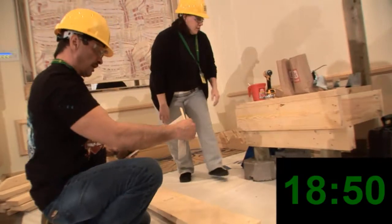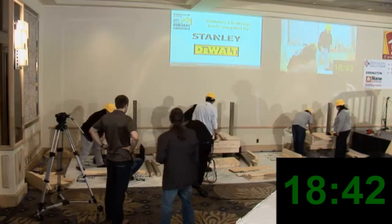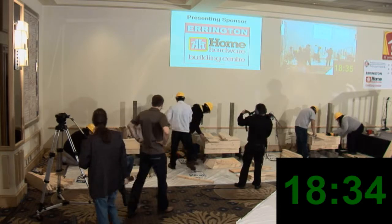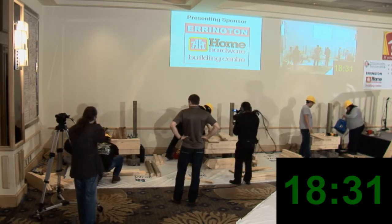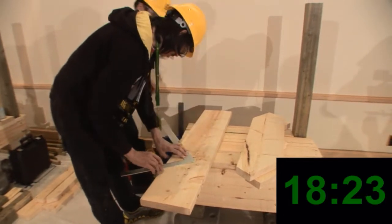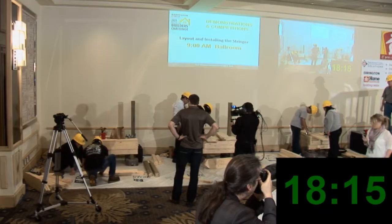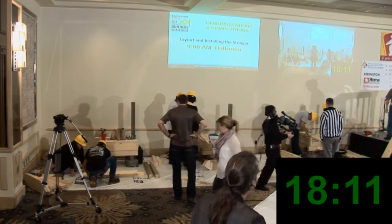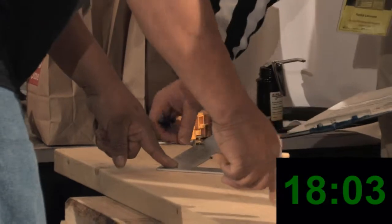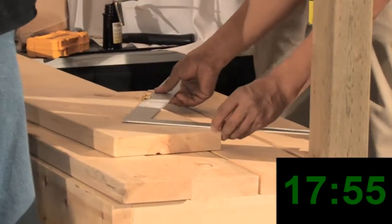Well, they seem to be going rock and roll over there. Now, after you've made your sketch on there, I suggest you take out your tape measure and check if you actually have 10 and a quarter, 7 and a half. Does that actually measure 10 and a quarter, 7 and a half when you measure the line? Check that out just to see that you're adjusted before you get too far. Oh, we're getting lots of lines on that board. Take your time and get that right.